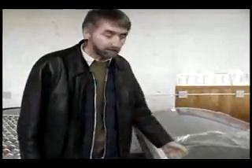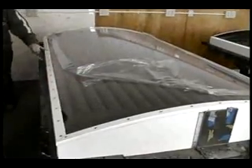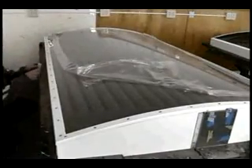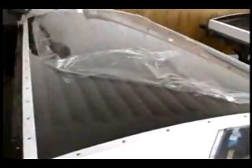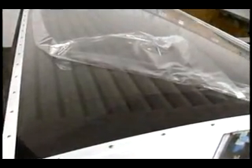The panel is basically made out of powder coated galvalume and UV stabilized polycarbonate, which is the lens area. The sun shines through this clear lens and hits the black aluminum. We have these 240 pop cans modified in such a way as to cause the air to spin through them, and centrifugal force comes into play, separating the relatively heavier colder air out of the rising column of air.